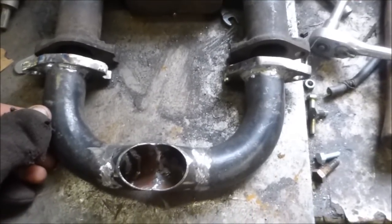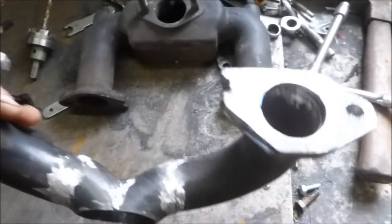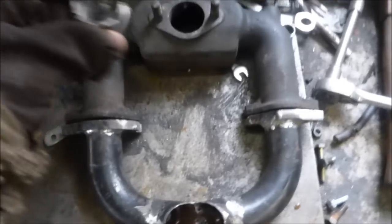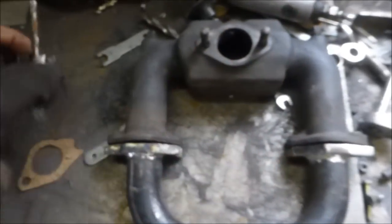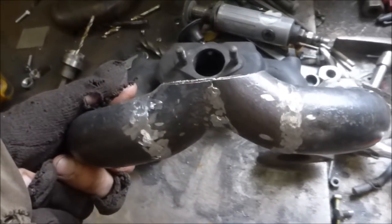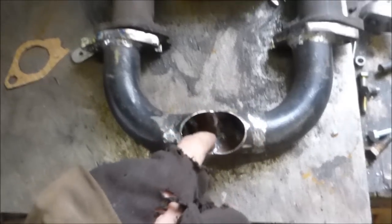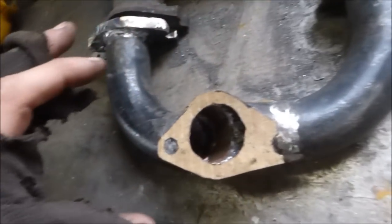It's going really well - I've got the manifold mostly made. I made the flanges and bolted them to the old manifold, then welded the pieces on. I drilled the holes with a hole cutter - an ideal one-and-three-eighths - these work really well for metal, drilled right through them. Made a couple of elbows. This area here is a little small the way it's oblong, but I think once I get the flange on there it'll be thick enough that I can taper it out and it'll be okay.